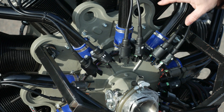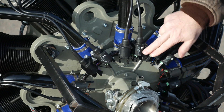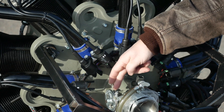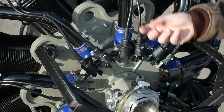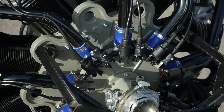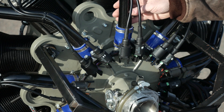On the rear side of the engine you've got your intake system, spark system, and fuel system. Here are the dual spark plug wires — each spark plug gets its own coil. There's a pre-wired ignition wiring harness on the engine. The fuel system throttle body has your throttle connection point here. The electronic fuel injection system has a plug-and-play wiring harness — you mount a separate computer on the firewall, the harness plugs right in, and each point is labeled with clear instructions.